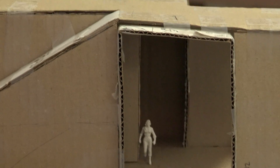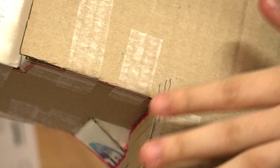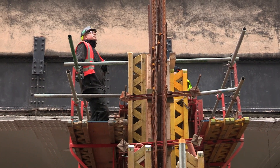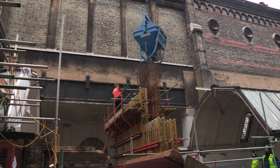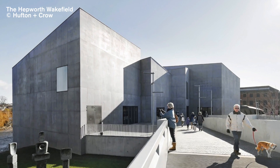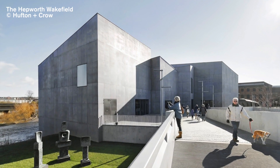You can see there are lines where we thought there might be potential for cracking, and we were talking about the reinforcement we might need to put in to mitigate that risk. This will be a two to two-and-a-half hour pour, and then once it's complete the structures will be struck over the weekend and you'll see the wall on Monday morning. The concrete is Fairface Concrete, which David Chipperfield has used before in other schemes, namely the Hepworth in Wakefield. We actually had the Concrete Society come along and give our subcontractor advice — there's been lots of heads together to get this right.